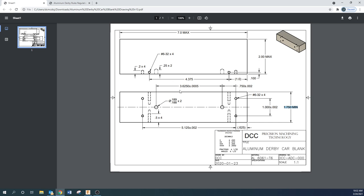This is the drawing that we prepped everything to — when we drew this in Fusion we prepped it to this print. I want you to notice this right here is a 1.75 minimum dimension — that is minimum. All the other stuff, like where the holes are positioned on this block, none of that really matters as long as this dimension is good. The reference dimensions are not critical; we're not going to be checking those.